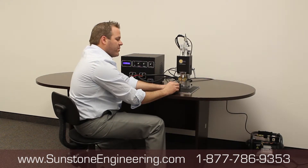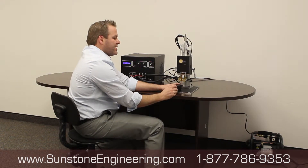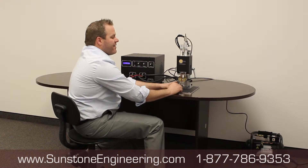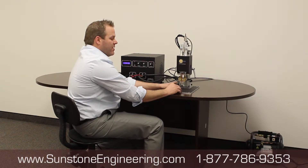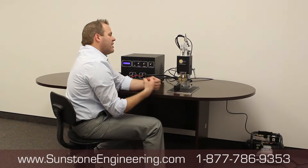Then look at the sandpaper to make sure the grooves are consistent — both grooves look the same, both lines marked on the sandpaper look the same. That tells you the electrodes are perfectly parallel, the pressure will be consistent between the two, and you'll get more consistent welds. That's what we're shooting for: something repeatable and easy to do.